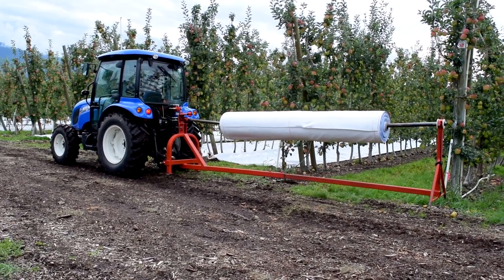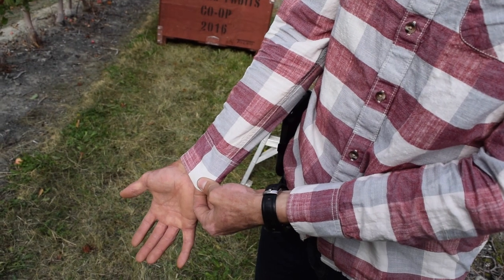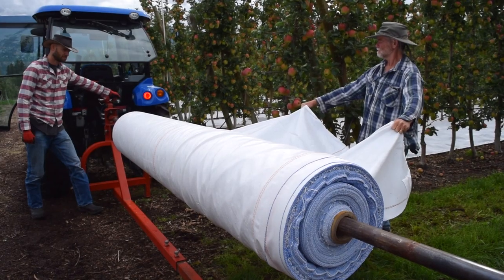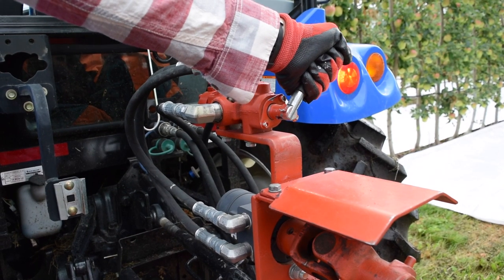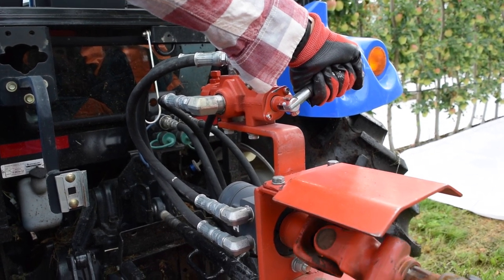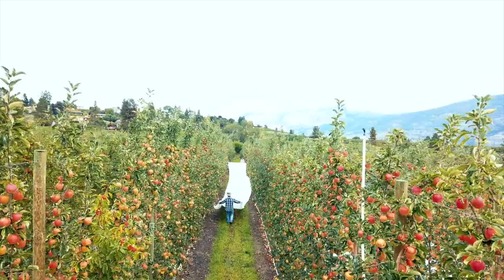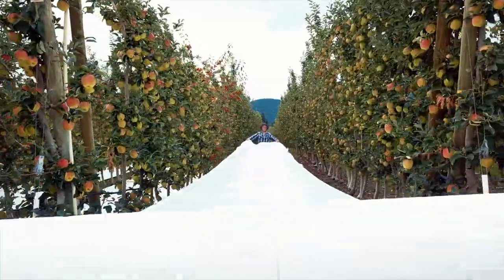Make sure the reflective fabric or tarp is centered as close as possible to the row, then get rolling. Safety is always first when operating any machinery — wear proper clothing that is not baggy and keep a safe distance from all moving parts. You will need at least two people to dispense the tarps efficiently using the roller machine. One operator should stand by the actuator valve so the speed can be adjusted or stopped when necessary, and the other worker should guide the tarp down each row so minimal adjustment is needed when fastening the bungee cords.